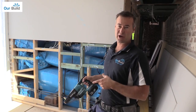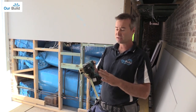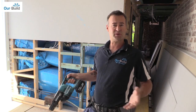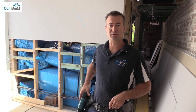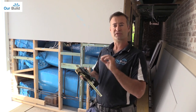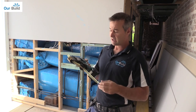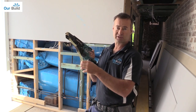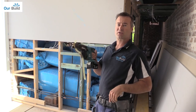I'm about to stick a plasterboard sheet on this back wall here. The main features of this are speed and convenience. When there's one person on site — I'm here by myself putting these sheets up — I can have this clipped under my nail bag, just pick it up with one hand and zip zip, away I go. You can adjust the depth so the screw doesn't punch through the plasterboard. You can take a full rack of collated screws that goes up through this little holder, which stops it from flapping around, down through the trigger and up through the top. So let's see how it goes in action.